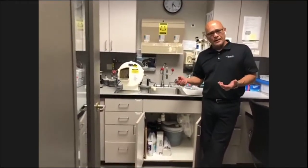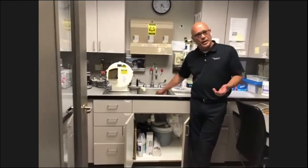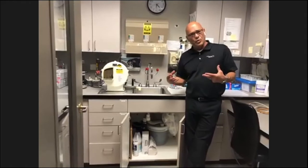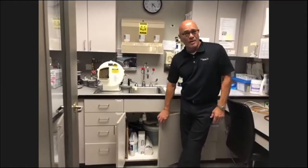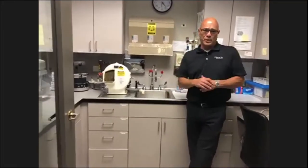You can take a little bit of bleach and just occasionally dump it down the drain, and that kills the bacteria growth that's happening in there. That odor is a common problem with plaster traps. So just a little bit of bleach will clear that up.